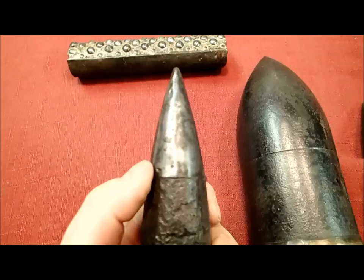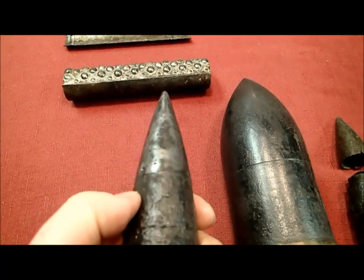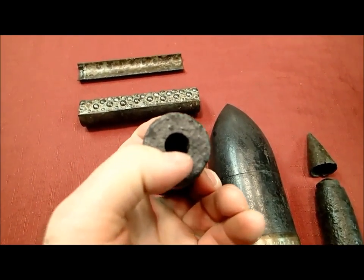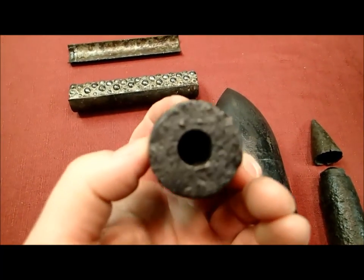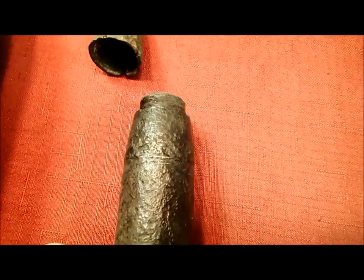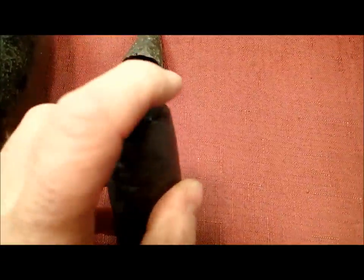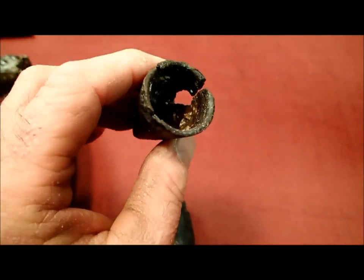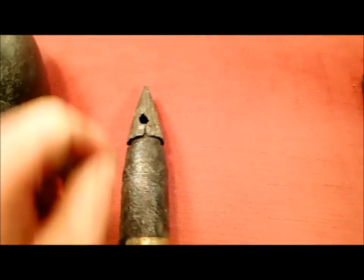A fuse would actually be a big plug in the base, maybe made out of brass or iron, so we can tell just by looking that this is not a fuse projectile. This other one is trickier — when you pick it up it looks like it has a fuse, but it isn't. The military calls this a ballistic windshield, not a fuse. The base has the same little hole, which just held a compound that acted like a tracer so the gunner could see where the shell was going. If you look in there, you can see it just ends — a fuse would be a much larger solid plug.